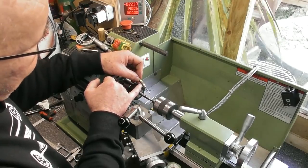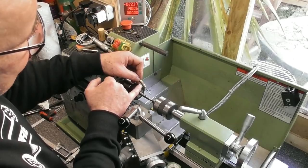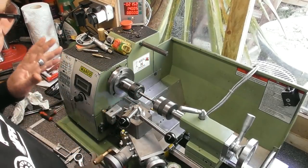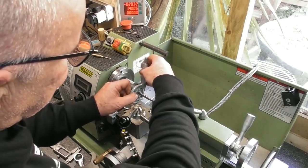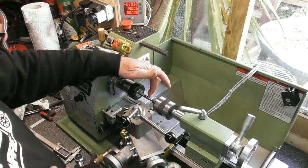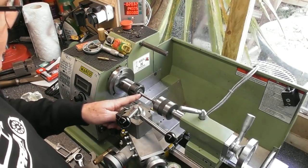This tungsten is a tough old material and I doubt I'm going to get very much increase in diameter when I knurl it — it's more going to be impressed in rather than raised up, about 50-50. So I'm going to start with 8.1mm diameter. I've measured up the existing barrel and it's measuring 8.8mm on its largest point. So I'm going to skim the barrel down to 8.1mm — the major diameter for knurling — and I think while it's at this stage is when we'll do the knurl, before machining the rest of the profile.